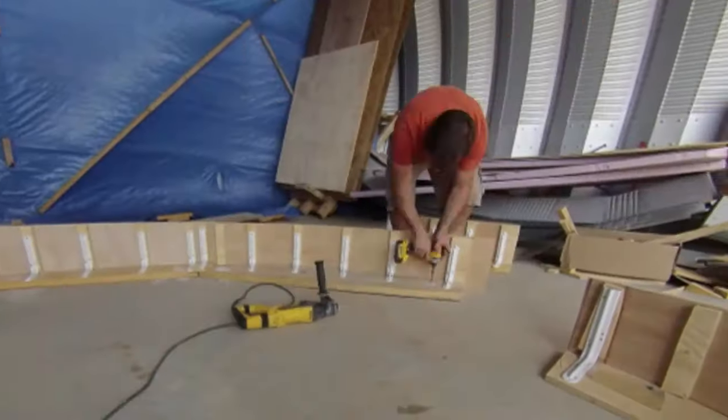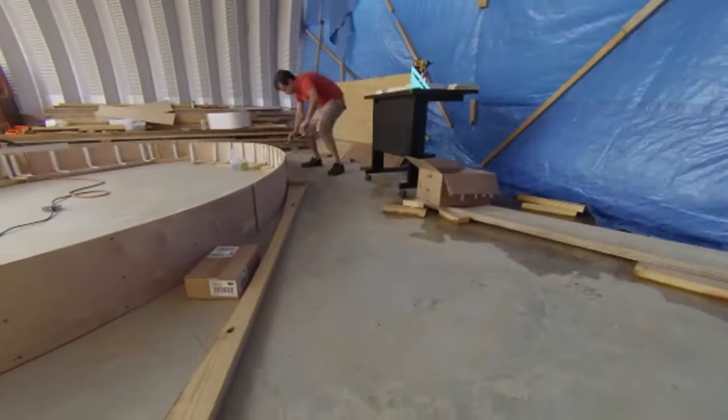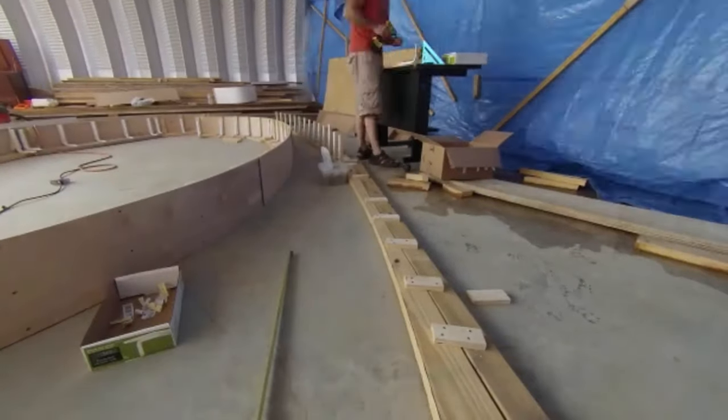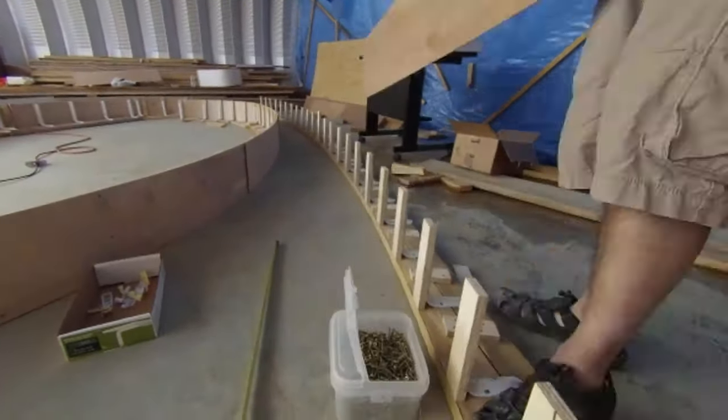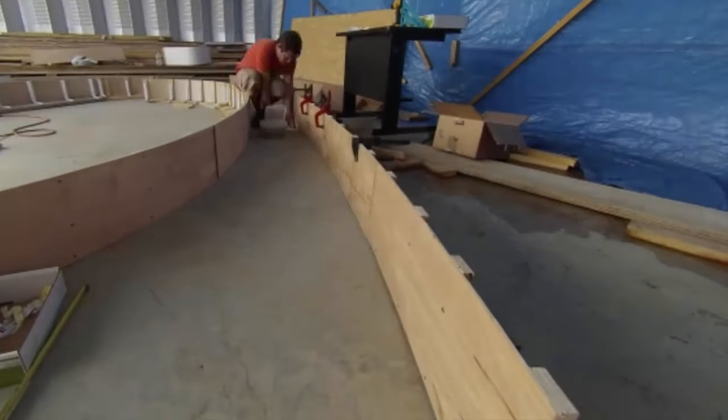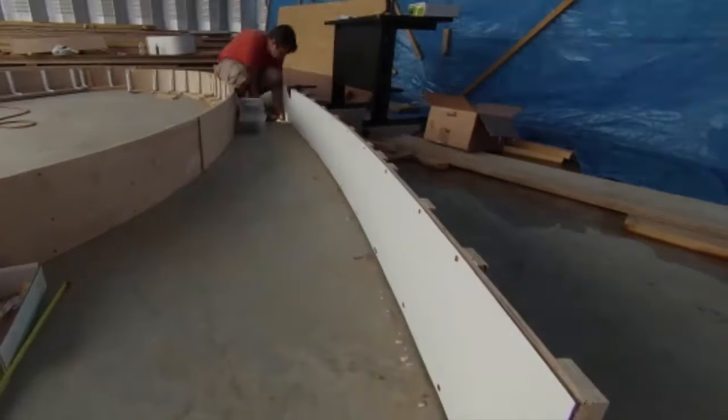To build up the form walls, I actually used 3 layers. The first two are very cheap Luan underlayment, which I always thought was a very pretty wood anyway. And then I overlaid these with very cheap whiteboard to give an even smoother, waterproof final finish. I was not worried about the screw holes because I planned to tape over them.